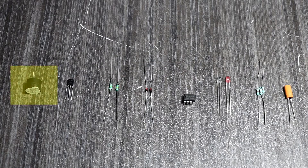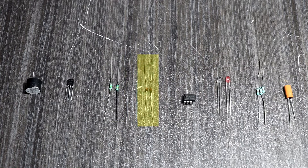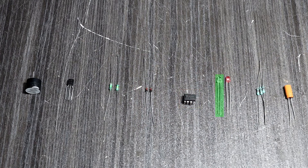For this project we need: a 5V buzzer, a BC547 transistor, 150 kilo-ohm resistors (2 pieces), Zener diodes (4 pieces — here I showed 2, but we need 4 pieces), a Timer IC555, a 3mm blue LED, a 3mm red LED, 1 kilo-ohm resistors (3 pieces), and a 47uF 16V capacitor.